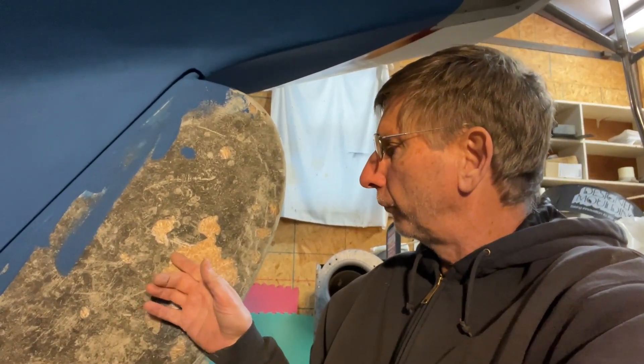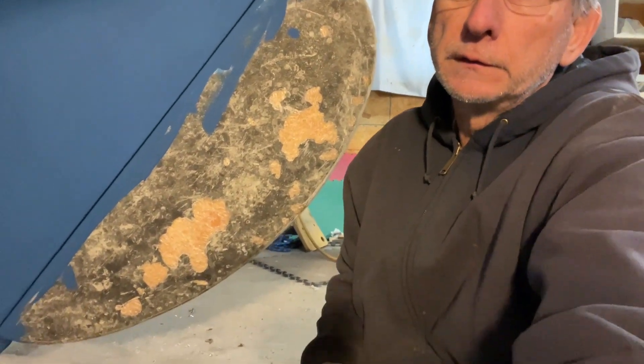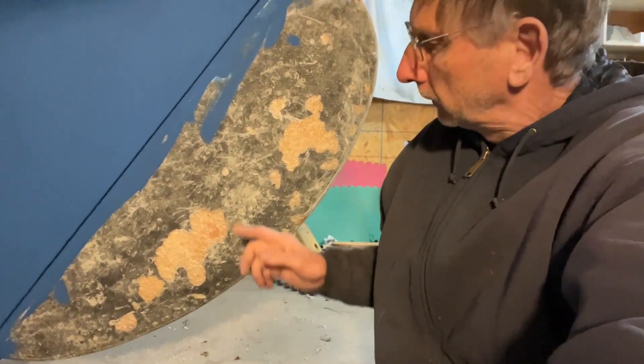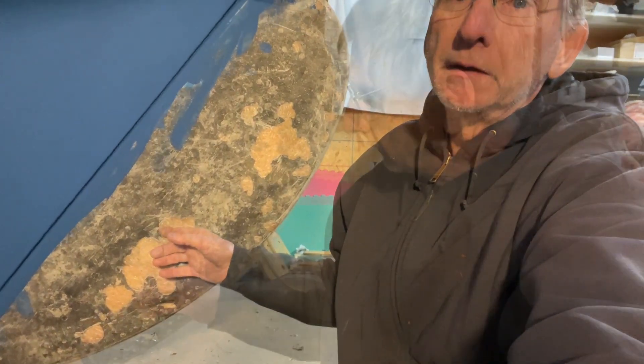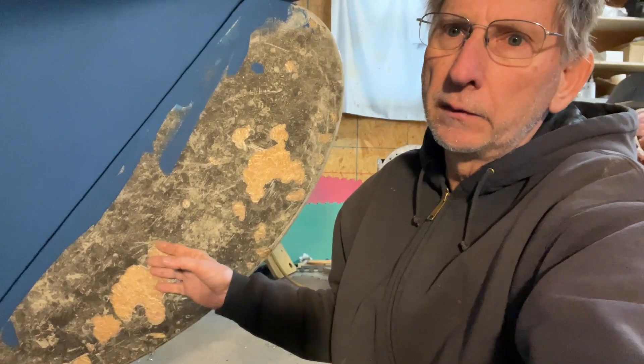It evidently wasn't prepped good or something, because whenever I pulled the boat out of the water, it did not appear to have any water in the rudder, which in itself was a bit unusual. As you can see, it's a little bit flaky. Some of it bonded and some of it didn't. No water inside the rudder and it didn't appear to be blisters — it just looked like it didn't bond.